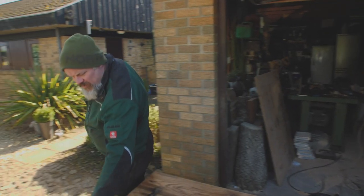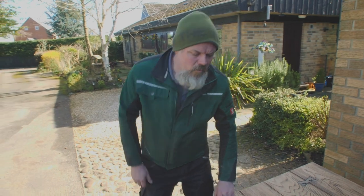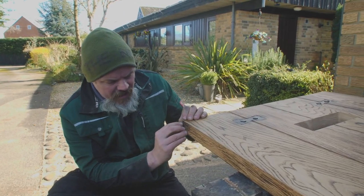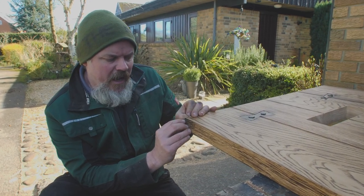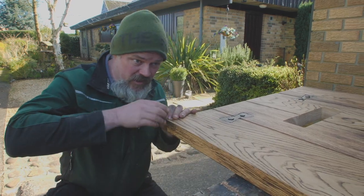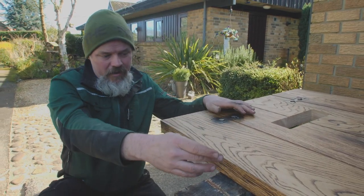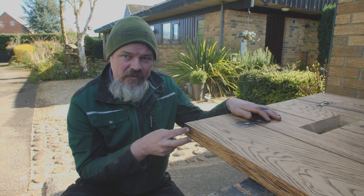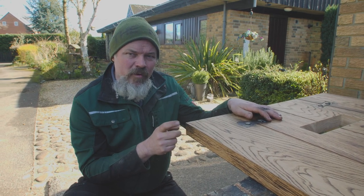So what do we do? How do we deal with that little issue? Well, the idea I've had is we're going to take this 10mm back and 10mm down with a router, essentially with a bearing cutter all the way along here, and then refinish it. That takes the edge of our door down to 35mm, gets rid of all of our problems for hanging the hinges.